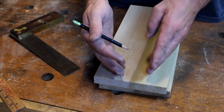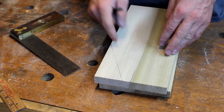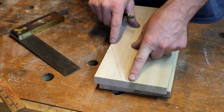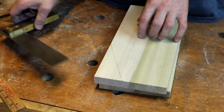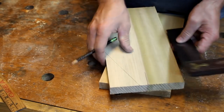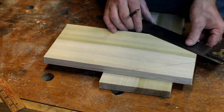For my two ends, I want a triangular look and we're going to have the dowel sticking through right here. The way I got this angle is I found the center point on the side, made a mark at four and a half inches down. This top is an inch and a quarter wide, so I can take my square and line up the two points.